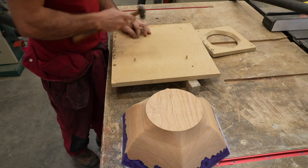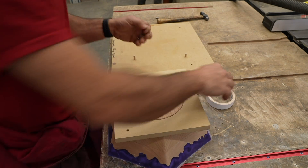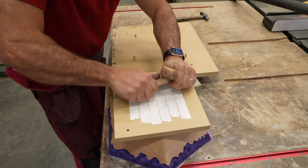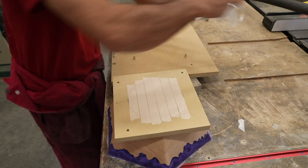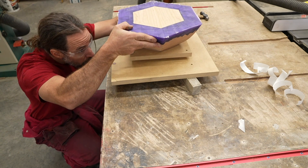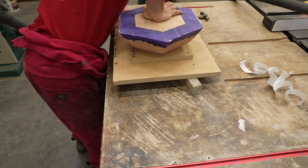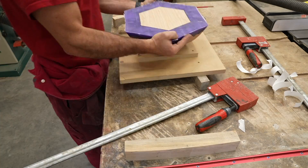I pushed some quarter-inch wood dowels into the spoil board so they sit proud about half an inch. I set the jig down on the bowl and made sure it was aligned really well without any slop, also making sure the front was pointing in the same direction as the bowl itself. I then taped over the bottom of the bowl and the jig, using as much tape as I could for really good adhesion since there was less surface area. The tape can also overlap the jig a bit — that's not going to be an issue because the jig is now sitting lower than the bowl bottom. I aligned the jig over the dowels by eye, slowly coerced them down into the holes, pushed it down with my hands, and then did the clamp-on, clamp-off technique to really get it to squish down.